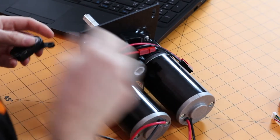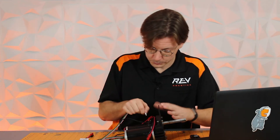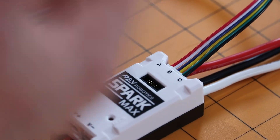Here we have a motor and gearbox from the kit chassis with a through-bore encoder already mounted. We're going to use the six-pin to six-pin connector to drive directly into our Spark MAX. If you're using a Spark MAX in brushed mode, you can use the six-pin to six-pin connector on the front of your Spark MAX with your brushed motors. Take one six-pin end and plug it into your encoder, then take the other six-pin end and plug it into the front of the Spark MAX — it's that easy. Through your Spark MAX API you're able to call that encoder and get distances with brushed motors, making it a really easy way to get up and running with smart robot features on the kit chassis.